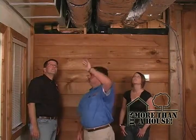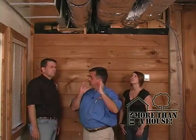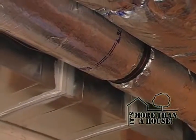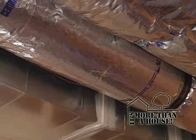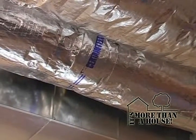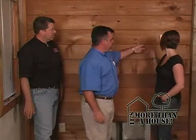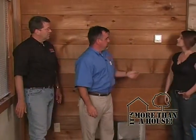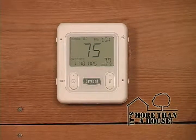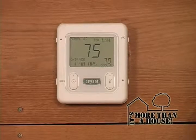The next ducts you see with the duct wrap on them are supply ducts — supplying cold air right now, or warm air in the wintertime. Each one of these trunk lines serves a different zone, so there's a zone damper on each one. Each one serves a different area of the house — the sunroom, the master suite, or the main floor. The whole basement is on a zone, controlled by this thermostat — a smart sensor — which gives you the ability to change the temperature in this zone without going all the way up to the user interface upstairs. It's so convenient to have, especially with two floors.